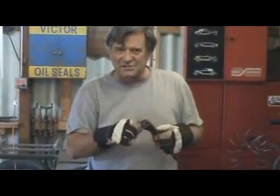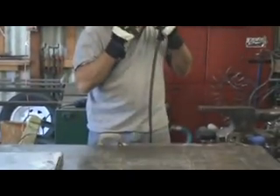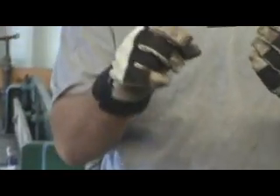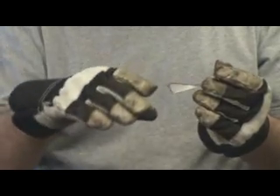It's great for thicker metals — this one will cut up to a quarter inch. It's very fast, but it's kind of messy, not like an oxygen-acetylene torch messy, but you'll see. So I just drew out a little pattern here — plasma on one side and nibbler on the other. See, this is what you get when you cut it: the side's hot, you get jagged edges. So you have to come back and grind all that smooth, plus grind on the back side to get the slag off. And you get a little distortion from the heat, especially on thinner metals — it will cause warpage.